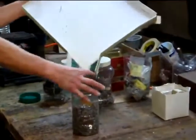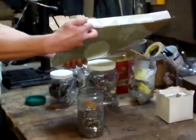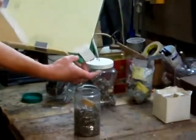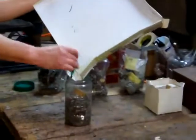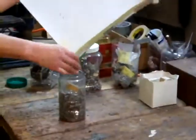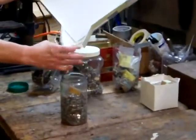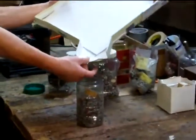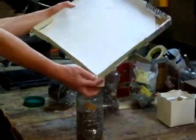I'd open it up and have this solid area for the parts to flow down. All I did was cut here, fold here, cut in the corner, and tape with masking tape and this ripstop nylon. I could actually test this, and it worked well except for one thing: when I had small parts, they would get caught in the folds of the nylon. So another corner of this same lid got pressed into service with the same basic idea, but instead of a flexible material, I have some solid cardstock that is taped to the wings, and this stock can fold under the corner.